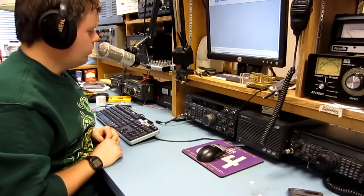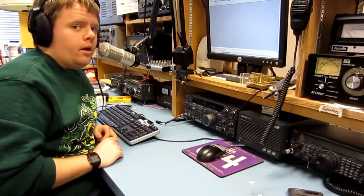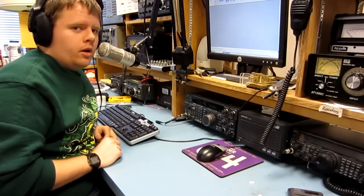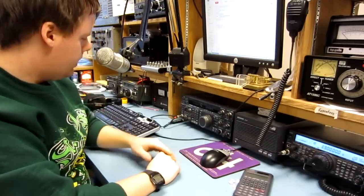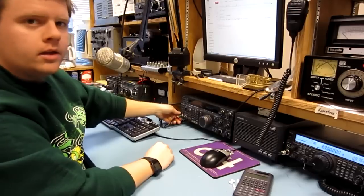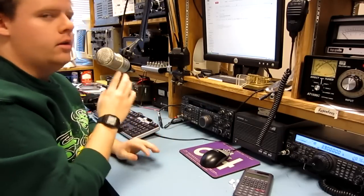So we're plugged right into the back of the computer. Now I'm going to plug it right into the front of the radio and see if I can get audio coming out of another radio through the computer or just through the microphone on the camera. All right, now I have the microphone hooked up to the radio. It was nothing more simple than plugging it into the mic input here. Make sure you have phantom power off, of course. You don't want to fry the pretty microphone.